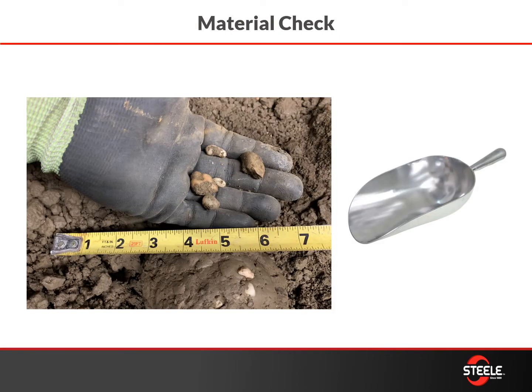What you want to do when you get a chance is check your raw material by having some sort of sample screen taken out of your lab. That gives you an indication — like, why are we getting this oversized? — and that would also encourage you to go check out your screening system.